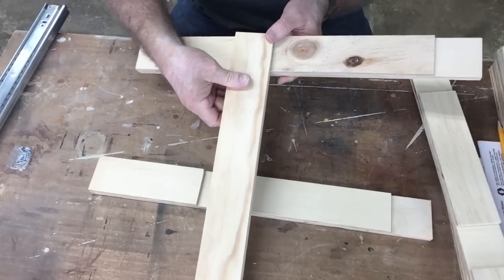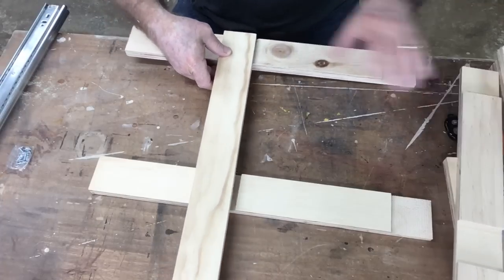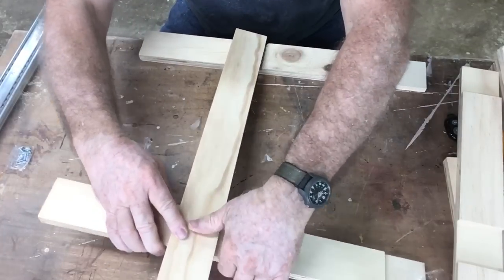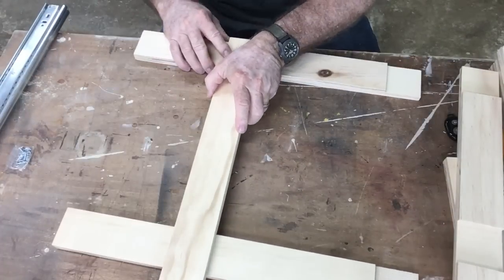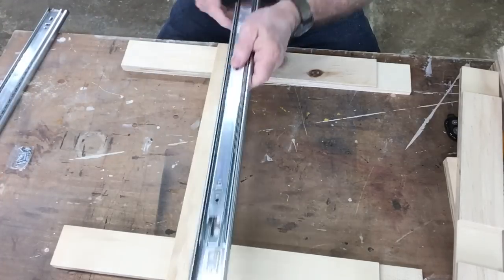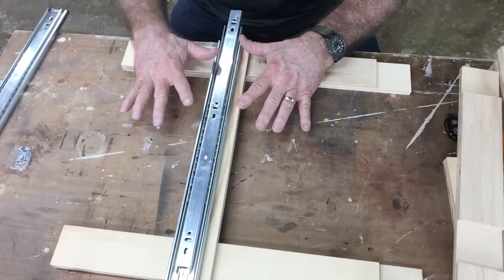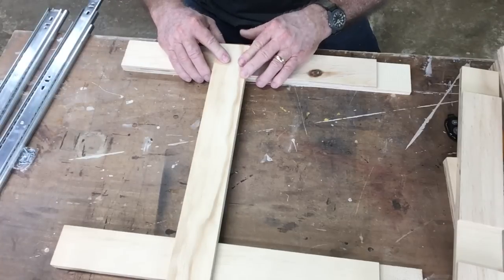To show how this assembles: the front piece has to be completely flush to the edge, and the back piece will also sit flush at the very end. Because you have to make a left and a right piece, the back becomes the front when you switch to the other side, creating a nice snug fit. The drawer rollers then slide right onto this position and screw into place. Once assembled, the whole unit screws into the cabinet as one complete unit.